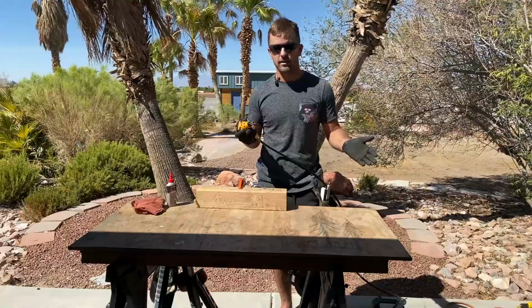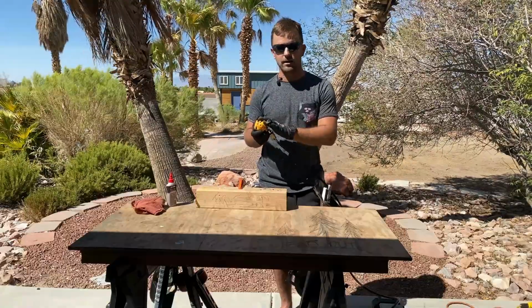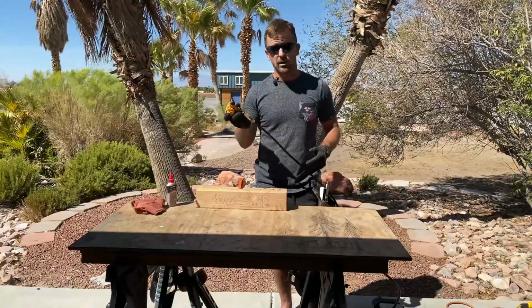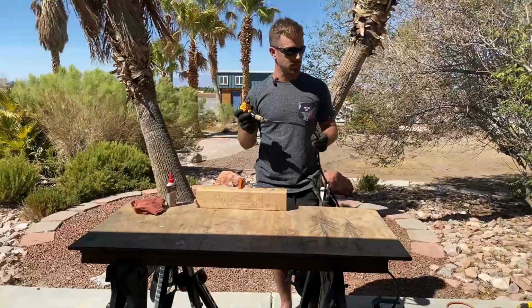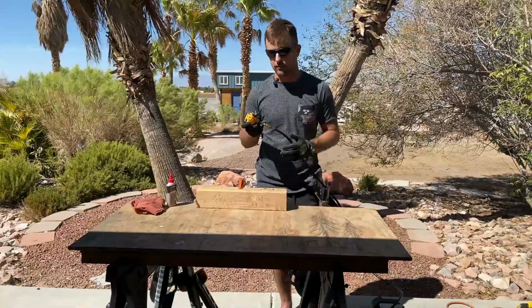We have a much larger tank at the build yard that allows us to operate our framing nailers, the palm nailer, and our other finishing guns on the same tank. If you have a much smaller tank, we recommend just using the one tool, one port at a time. That way your pump is not constantly running.